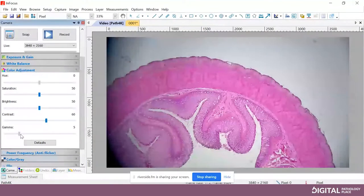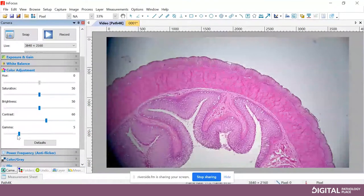Five is optimal — five is more or less what I see under the microscope. So the two things out of the box with this camera — and with most cameras — is you want to do a white balance for sure, and you may have to tweak the colors because every sample is different. The other option you may want is to hit Flip. Flip is to orient the eyepiece image to the camera image — so if you look through the eyepieces, your sample is going down instead of up, and the flip allows you to match the orientation.